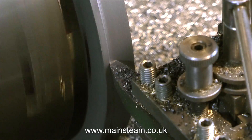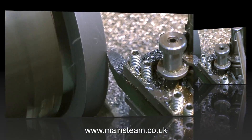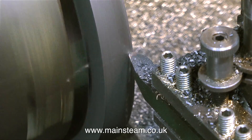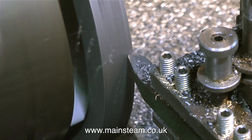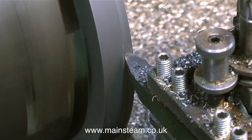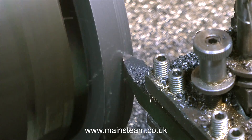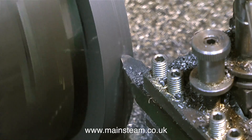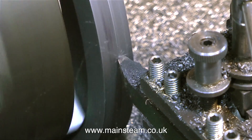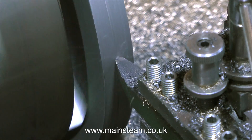The work is running slightly eccentrically because the hole in the middle really wasn't exactly in the middle. There are different ways of doing this job — if it was a precision item, I would not do it this way. The reason I've done it back to front is to illustrate the fact that even if you have a very small lathe, you could use the external jaws of your three-jaw chuck, grip the internal dimension, and profile the outside entirely this way. You would have to leave the inside part a bit rough, but that isn't a problem because this is only a support for an ash pan, and once the ash pan is bolted to this support, no one is ever going to see underneath.